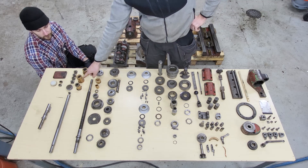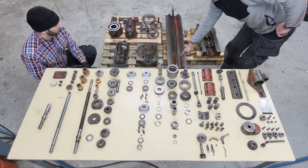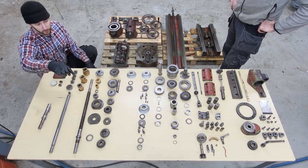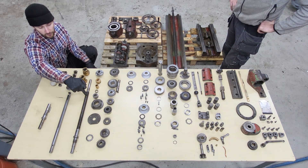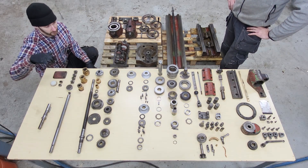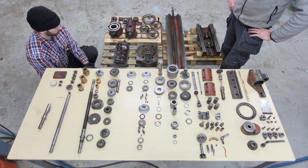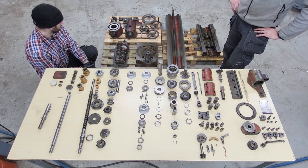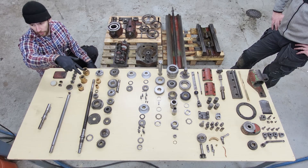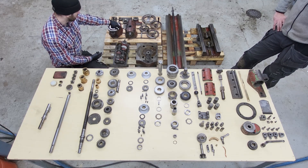These two are the ones for the lead screw — you can see it behind, just there — so those will be replaced. And this one was for the y-axis, so this is the lead screw for that. And the lead screw — we might have a surprise later on — hopefully that will work out. All the gears look good. The bearings we will replace — the bearings for the lead screws, and of course we have new bearings for the gearbox that goes on the milling head itself.